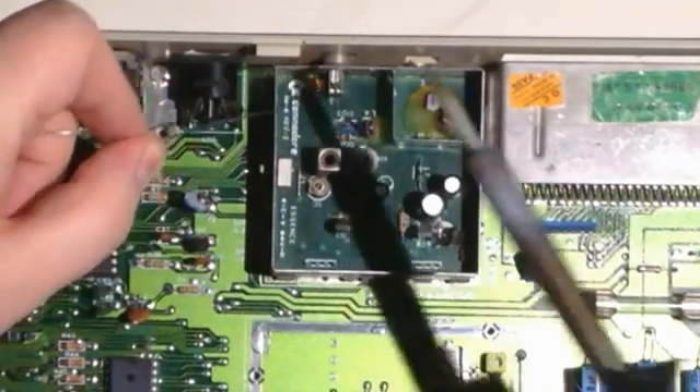So what we have soldered: down here we cut this wire and drawn the composite out to here. There's another point here — as you can see, this is the modulator and we want the composite signal. There's no composite signal coming out of the VIC chip directly — you need some mixing here to get the composite signal. You can't just remove the modulator — that's the point.